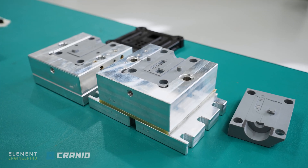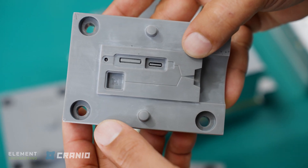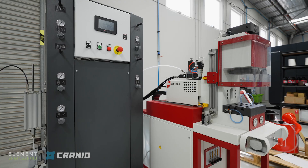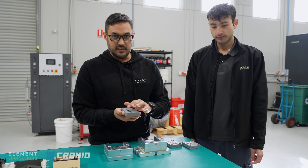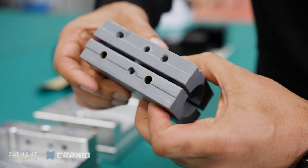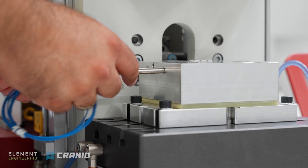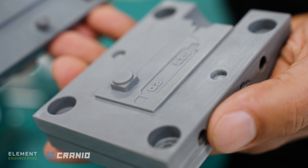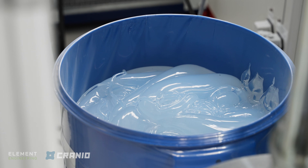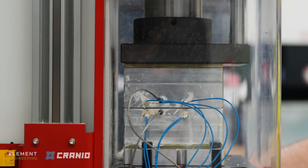We found out the hard way we can't use this material — 3D printed resin — to be used in liquid silicone rubber injection moulds. The main reason is the conductivity of the material is so low that the temperature wasn't getting from the heater probe through to the thermocouple. It was warm where we used it but cold on the other side. For liquid silicone rubber to set, the mould around it needs to be about 180 degrees.